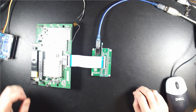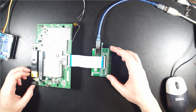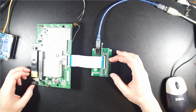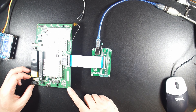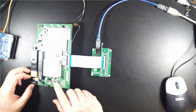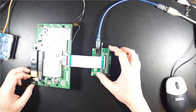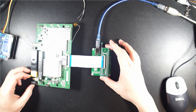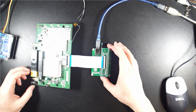In this video we talked about the basics of this adapter and how to do proper soldering. For this example of the D-Link 868L router, the chip is oriented opposite, so we need to clip on like so but flip the board. With this kind of setup we can program this NAND flash on the board quite easily.